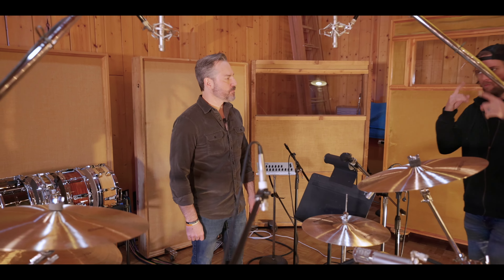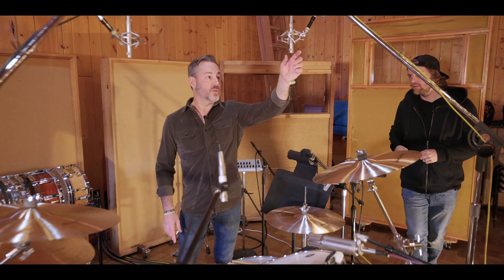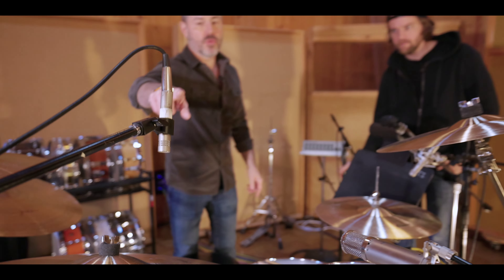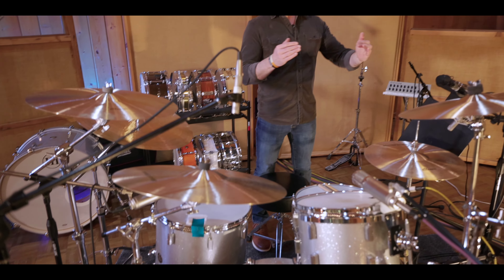Are these the WA-84s? It's a combination. The overheads are the Warm Audio 84s, and I've got seven or eight of them here. I have three of the vintage ones — the KM-84s. Always loved them, but the problem with KM-84s isn't the sound. The sound is amazing. The problem is they have a very low output and they're noisy because you have to gain the fire out of them. These sound like a KM-84, but they have a much hotter output and they're quieter.